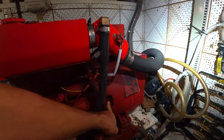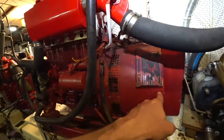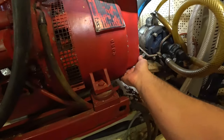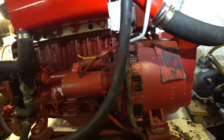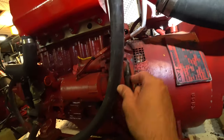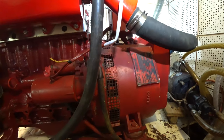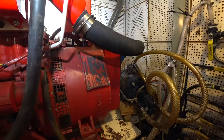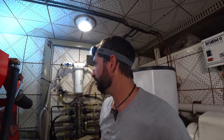But now the back end of the unit, where it produces the electricity, needs to be addressed. We need to pull this housing off of the back of the generator—essentially remove it from the engine block. We need to support it back here so that when we unbolt it, it doesn't come down onto the armature. So we've got to remove the starter, disconnect some wires, and go around and unbolt the housing from the engine. It looks like we've got just enough clearance to get the back end off. We'll get to the armature, take it to Tampa Armature to have it rewound, and put it back on—hopefully everything works great.